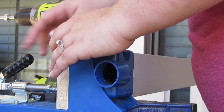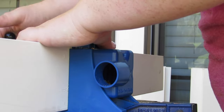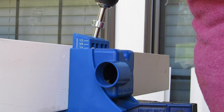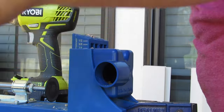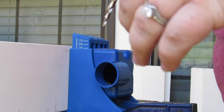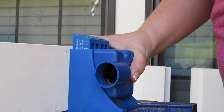So this is going to be 8 of these back slats. They're going to go all the way across the back of the gate, and we are going to drill 3 pocket holes. If we have 8 of these, we're going to drill 3 pocket holes in 7 of them, we don't need them in the eighth. So I'm doing one on each end and one in the middle.